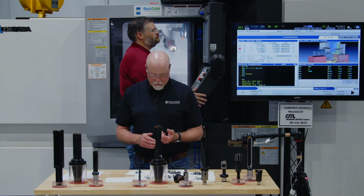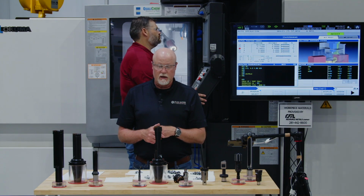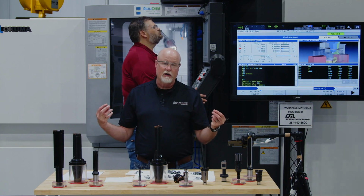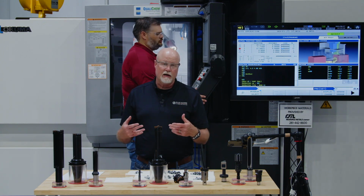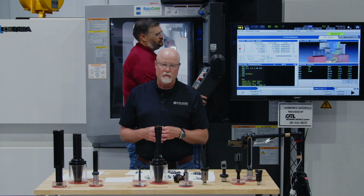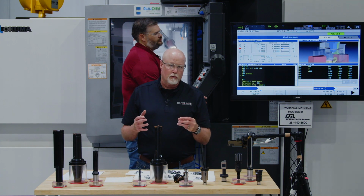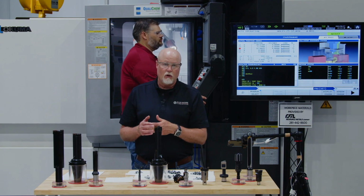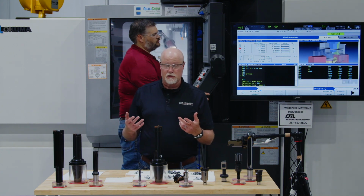The types of applications you're going to use that for would be hydraulic manifolds, hydraulic cylinders, things like that, because now I have to plug a hydraulic port into that. It's made to an SAE or an ISO standard port form, and we have several different ones. I'm going to create that whole form at once. Then all I have to do is come in with a threading tool and thread the hole, and then drill another hole to intersect my feeder line, and the application's done.